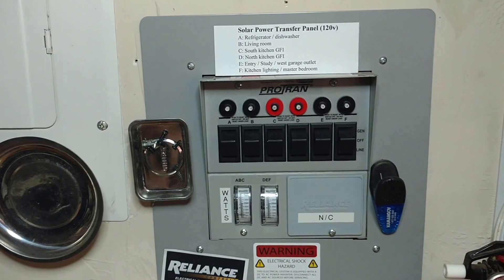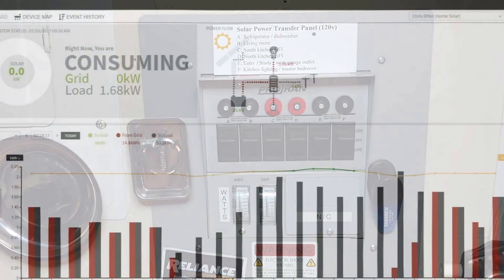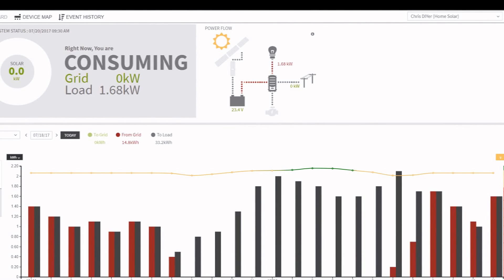Let's look at a typical day and how many kilowatt hours this house uses. This is from my Outback Power inverter — it monitors everything 24/7. As you can see, at about 7 o'clock is when I turn off the grid and start making solar power, storing and using it. It runs until about 7 p.m., when it automatically switches back to the grid. Right now I'm running about 50% off-grid in the summertime. During spring and winter I'm close to 80-90% totally off-grid.